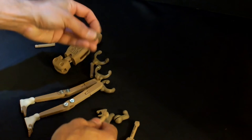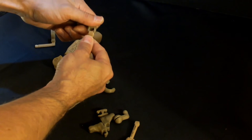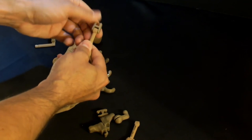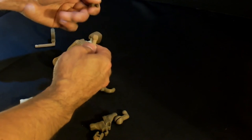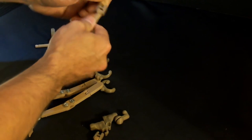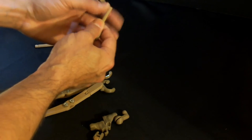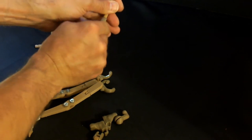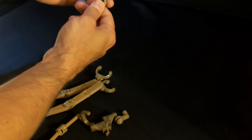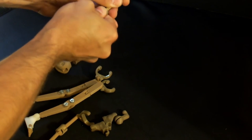The order here is really important, and you want to go in reverse order when you insert the new one in. These can be pretty tight fitting, so make sure the forearm goes in first and that you've aligned the hinge with the socket. You may have to hold firmly onto each piece with both hands. Then orient the upper arm sideways, press it in, and do a couple turns to break into the joint so it turns smoothly when you operate the armature.